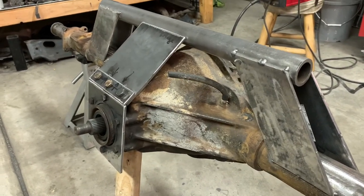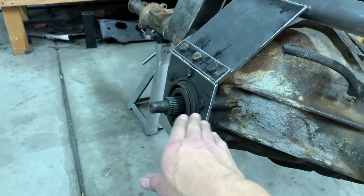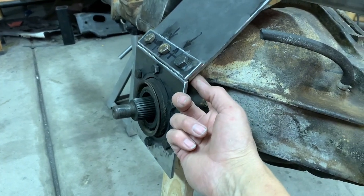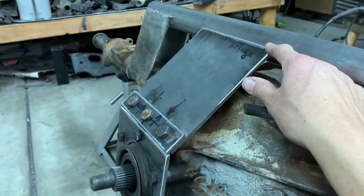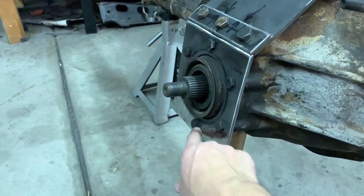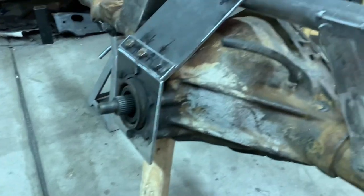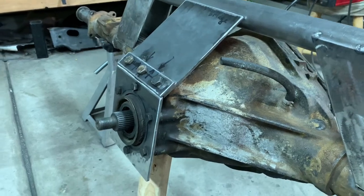Update for the night - we're turning cardboard into reality. Pretty simple design - got the plate cut, all drilled, all that stuff, took forever. This is going to weld here with some nice gusset on the side. I got clearance under there - I'm just going to weld nuts underneath for the bolts. I think I'm going to work it down just a little bit more to bring it lower on the tube. I still need to clean up my three pieces I cut for the pinion guard. All my hole saws are kind of burned up so we'll probably make some triangles on it. Should get out here tomorrow for a little while and make more happen.